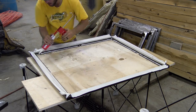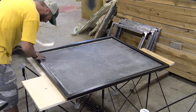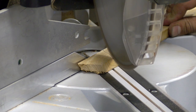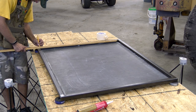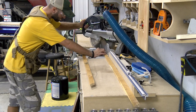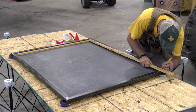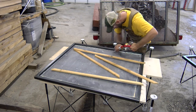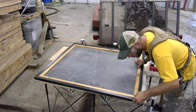With the lacquer dry, we can apply some construction adhesive to the flat bar we welded onto the steel frame and then drop in the chalkboard slate. The tape was there to help prevent scratching and avoid getting construction adhesive on the metal. At the miter saw we cut the 45 degree joints on our cedar parts. We first cut the end joint, then bring it over to the actual frame and mark the end position of the cut. We head back to the miter saw, use our zero clearance insert, and match it up to the mark we made — a perfect, 100% accurate cut. Once the first one gets put in place we repeat the process, butting each 45 degree joint to the last, working our way around the frame. It's a slow and tedious process but the results are perfect. Once all parts are cut, we apply construction adhesive to the slate and the steel, put the parts in place, and secure them with spring clamps.